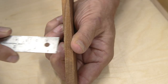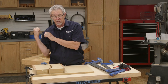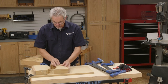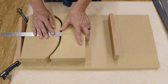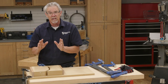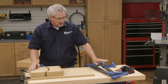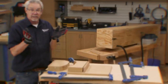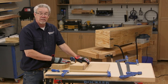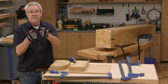Now these pieces are three-eighths of an inch thick, so they'll take at least 25 minutes of steaming. When the wood has been steamed for a sufficiently long period of time, you're going to need something to bend your stock around. I chose to make a two-piece mold — you'll notice that it's built so that there's a perfectly sized three-eighth inch gap between them. If you want to learn how to do that, you can look at that four-page article I referenced earlier. Also, I'll need three strong clamps. Okay, it's time to bend some wood, but there's one thing I should note: if you're going to get into bending wood, you're also going to be breaking wood. It just goes with the territory — there's no guarantee. So, here goes nothing.